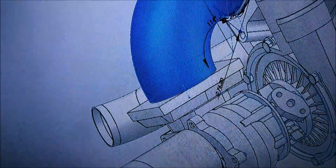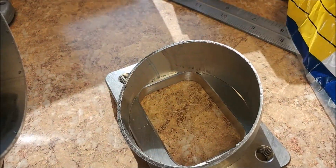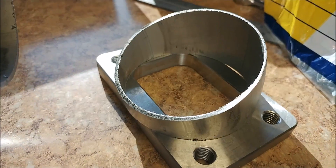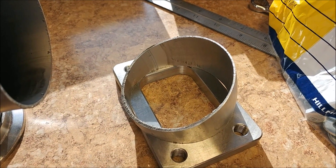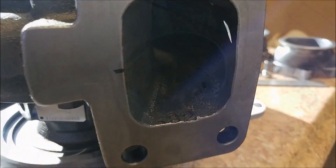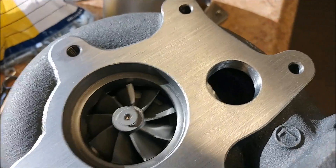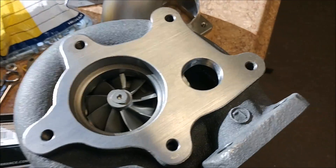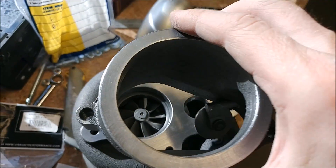The screen shows the part we're creating — coming out of the first turbo and going into the second turbo. It has a v-band on the top and a flange on the bottom. This flange here is similar to what I have, but I've ordered a larger T4 transition instead of T3, so we'll get a better mating from the larger three-inch down to the smaller opening. Let me show you how the turbo wastegate works — there's a big hole in the side where extra pressure can be relieved and bypass the turbine wheel.